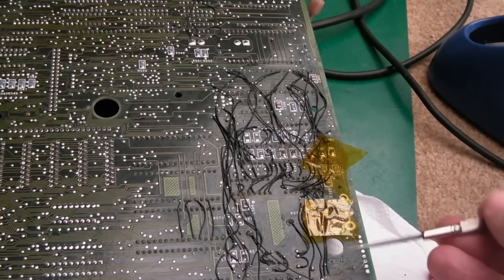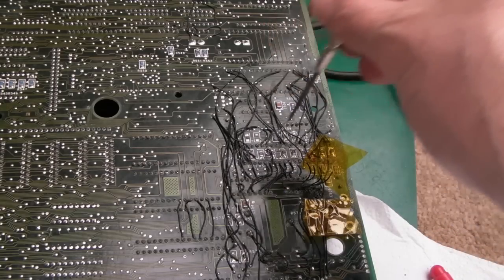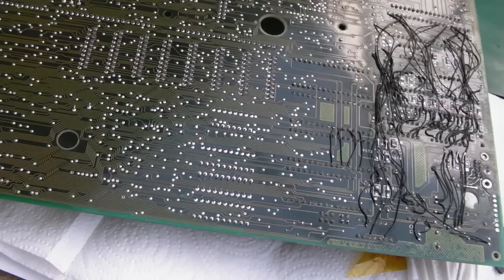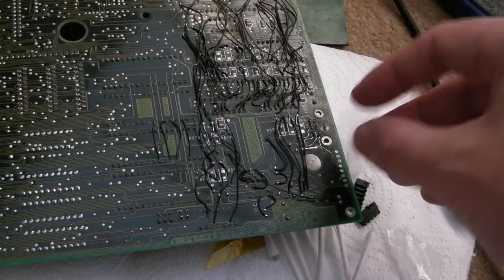It's very, very time consuming. It took me about 45 minutes to get to this stage of replacing one of the four connectors there, because there's actually four, you know, they're in halves, aren't they? So I finally see light at the end of the tunnel. After we swapped that power switch, and that solved the arcade issue, obviously we had the keyboard problem and a mouse problem. Yeah, the mouse problem was just a bad solder point.